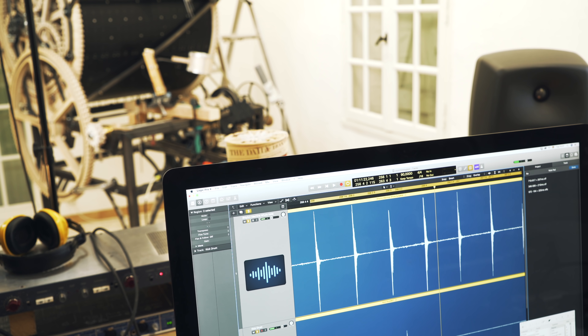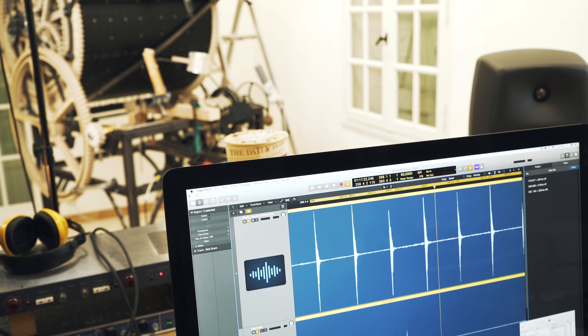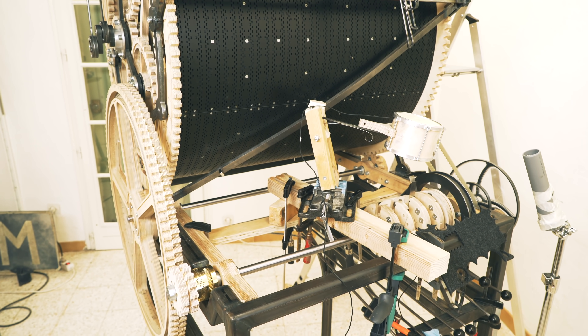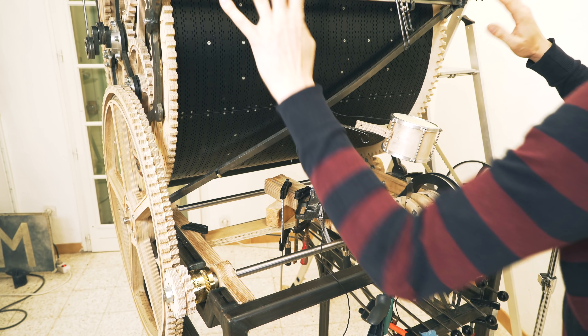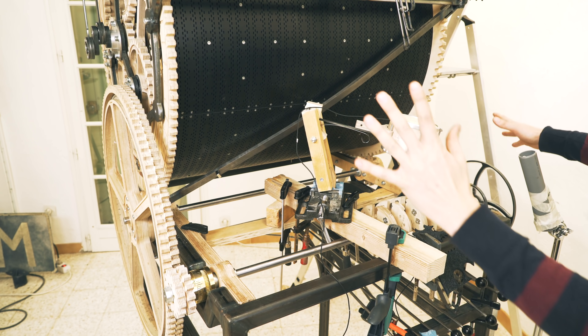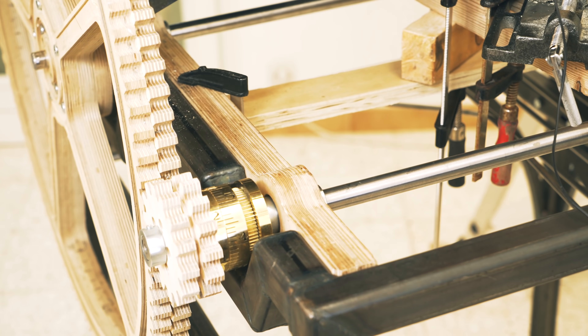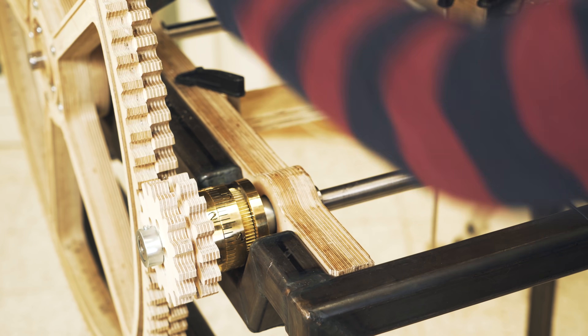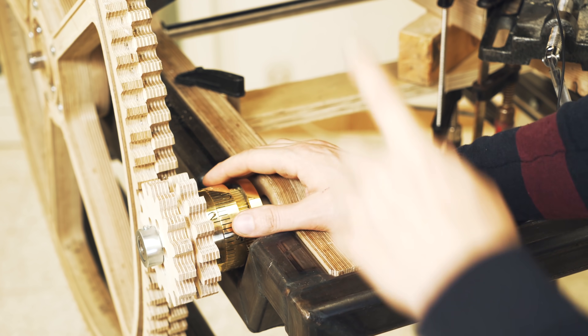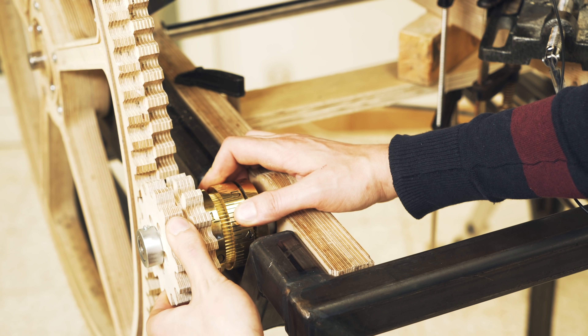So now we're going to take this kick drum stroke and move it to hit that rhythm machine stroke, which means we want the kick drum to play earlier. That means we will offset the programming wheel earlier towards the crank with the indexable clutch. On the Marble Machine X, the relationship between the crank and the programming wheel is sacred — it's a 1-to-64 gear ratio and they are really, really connected exactly to make all this line up musically. But with this timing clutch we are able to break this gear train and adjust the relationship between the crankshaft and the programming wheel. We wanted the programming wheel earlier, so I'm going to move ten steps.